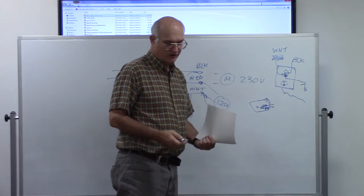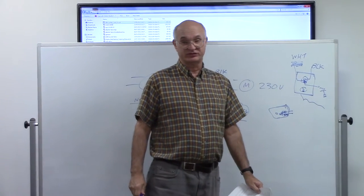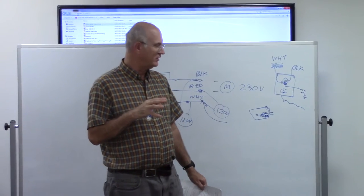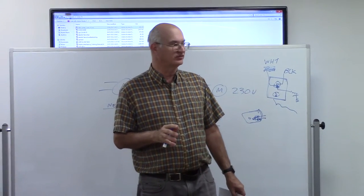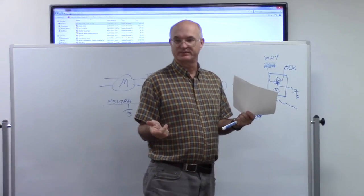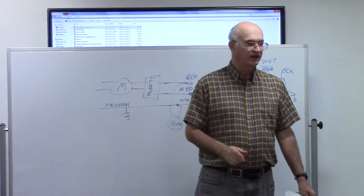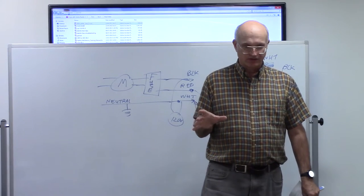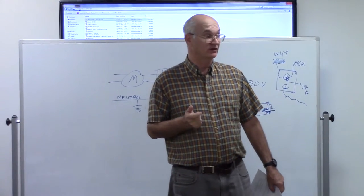Later on, if you start playing around with some of the more advanced amateur equipment, even radio transmitters themselves, some of the old tube gear, they use very, very high voltages. And they're not enclosed in metal cages for no reason. So be very, very careful if you're going to be doing anything like that. If you take the lid off a piece of equipment, just respect the voltage if it's plugged in. Also, even if it's not plugged in, you've heard about capacitors? You know they can hold a charge? Well, some of these old high voltage power supplies can hold a charge for days or weeks. And there's enough there to give you a really good zap, possibly seriously injure or kill you if it makes the right connection. So these capacitors will still hold a charge even after it's unplugged. So when you're messing around with these high voltage areas, you should know what you're doing or leave it alone.